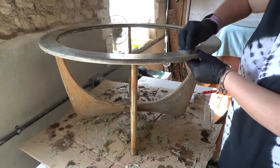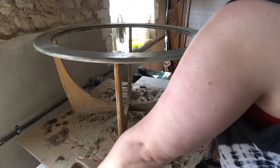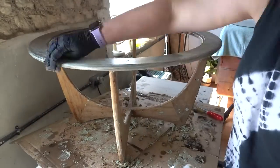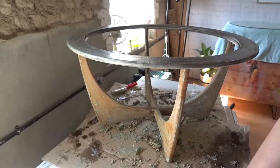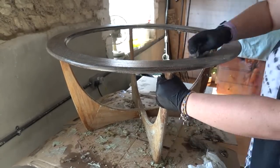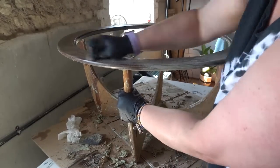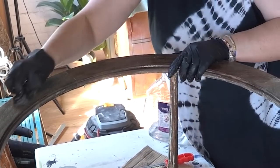Because this is an eco stripper, you don't need to use mineral spirits to neutralise it — so I'm not using it for that purpose. It's more for the purpose of removing what's left of the paint. If you're going to be doing a project like this, just be prepared for the mess. I'd definitely recommend laying down some cardboard over where you're working, because all the paint that comes off with the stripper and the mineral spirits is a complete mess.